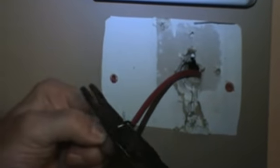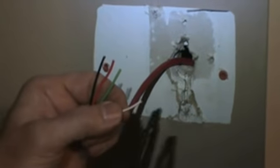All right, I have four conductor wire. That's what I wanted. I'm going to strip. Now, remember how I bent this and pulled it and all that? I'm going to clip that stuff off. I don't want to have any problem. All right, so I have four conductor wire. Strip it, 3/8, roughly.